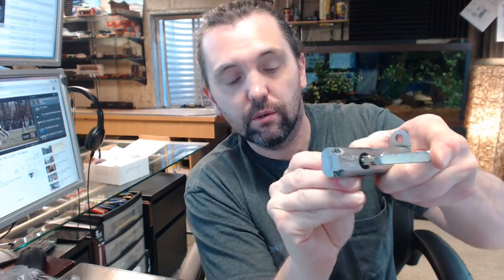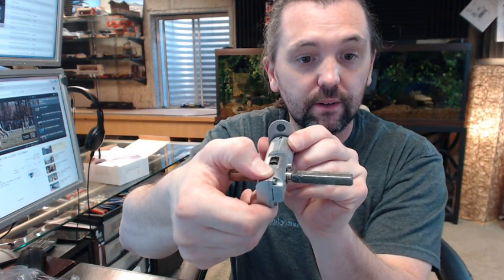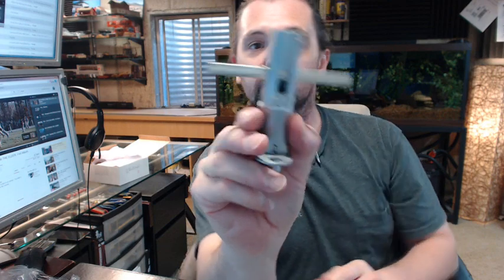Pass the half section assembly until it stops on the notch marks — the notch marks are on the inside portion. Each half of the spindle must rotate independently. We are going to push so that the ball detent comes in — now that it has snapped in, you probably heard that, but you are not in yet. You have got to stop when it gets to the notch. I found that I had to tap it a little bit with a tack hammer very carefully to get it pushed in without stressing the latch bolt. What happens then is the ball detent gets all the way to the other side — you will know it is correct because it will appear symmetrical and both sides will operate independently.